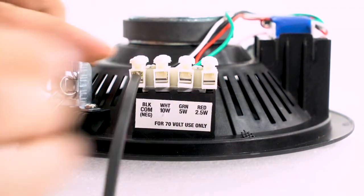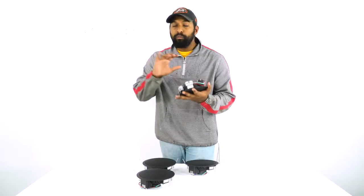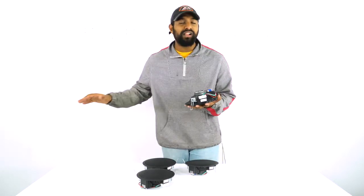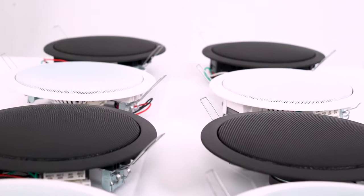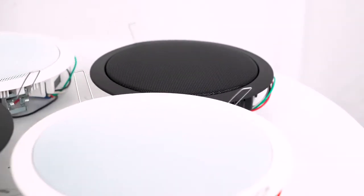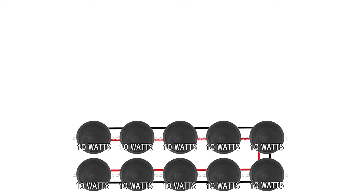It's very easy to tap these speakers — you put the negative speaker wire in this hole and then depending on what wattage you're tapping at, you put it in one of these three spots. Wiring in 70 volt technology is super easy; it's all parallel wiring, so you just go positive to positive and negative to negative all the way down the chain. You can also mix and match these with other styles of 70 volt speakers tapped at different wattage amounts. The one thing you do want to double check is the total wattage of all your speakers combined and make sure your amplifier is capable of producing that power.